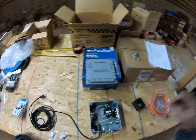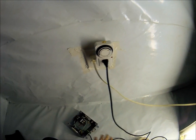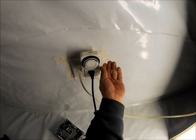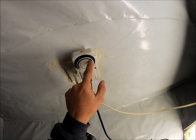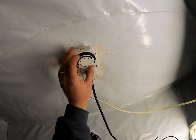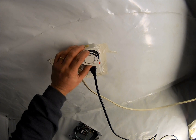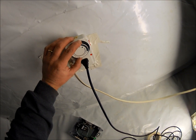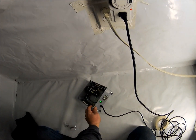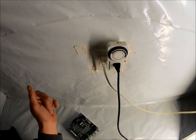I've got the timer set up and just as a test - the unit has no power now but the contactor will still close in as soon as the timer comes on. Right now it's about 10:30, so if I time-lapse to eight o'clock you're going to hear a little click - that's the unit coming on. Now the lights would have just come on. You can see the indicator light is on, so that's telling you it's working. If the power was here it would now energize those outlets and turn the lights on.